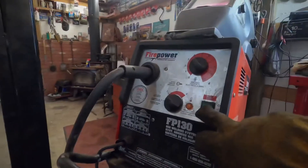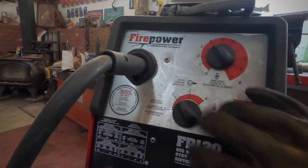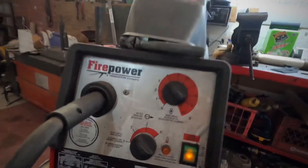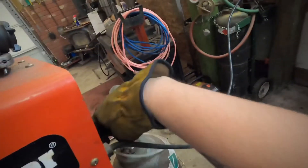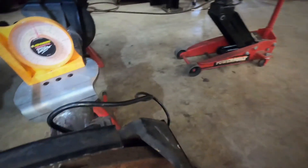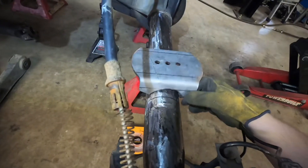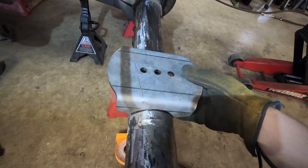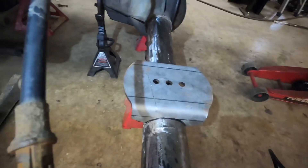I've got it close already — right about six, six-and-a-half, seven degrees. Setting up the welder: heat on two, should be hot enough, feed speed at about three-and-a-half, and turning on the bottle. Checking we have gas — already checked. Going to get the ground strap on there.